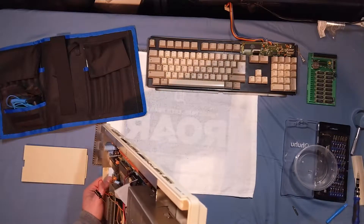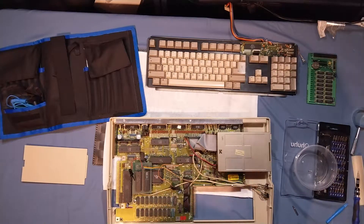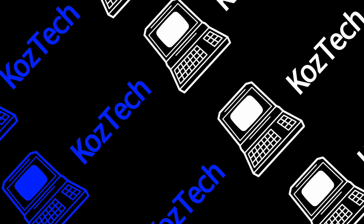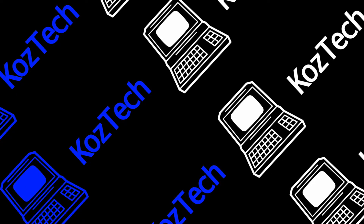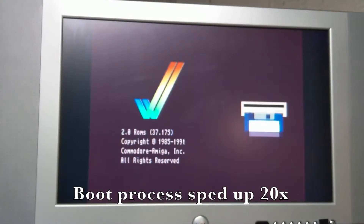I'm not sure if the floppy drive works — I was given a set of floppy disks. It does look a little dirty in there; I might have to take it apart and clean it, which will require using some IPA — isopropyl alcohol. I do have footage of the reassembly, but both cameras were recording blurry images for some reason — I'm not sure why. I got it cleaned up as best as I could, though it wasn't really that dirty to begin with, so it didn't take too long. I also replaced the RTC battery on the RAM expansion board. I do have some additional footage of it booting up and me struggling to get it to boot from the floppy disk. Turns out when I took it apart to clean it, I didn't put it back together quite the right way — once I figured that out, it booted up just fine.